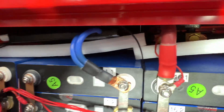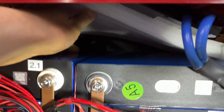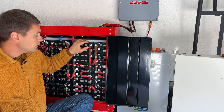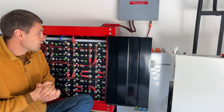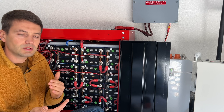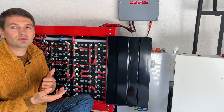I'm not sure how it's going to affect performance, but this is what we have. For improvements to this battery bank, the first thing after seeing these swollen cells is to clamp them so they cannot move much. Another improvement is to use a BMS that can communicate with the inverter, so we can control charge and discharge using communication between the battery and inverter, not just voltage.